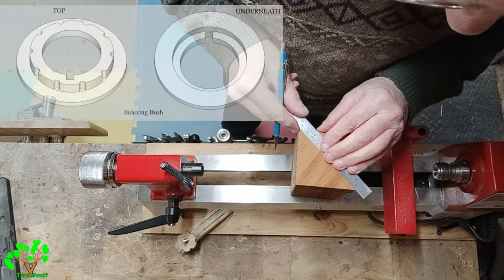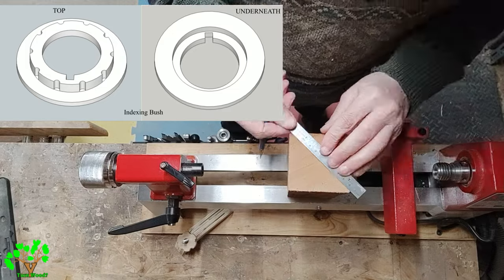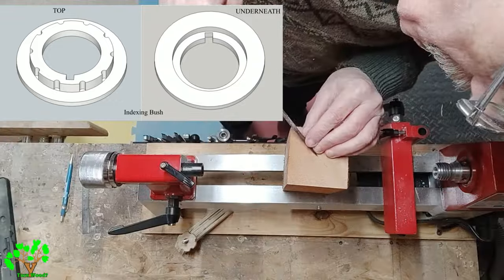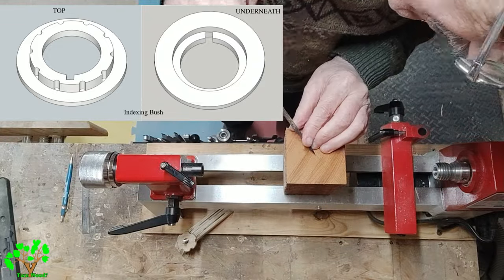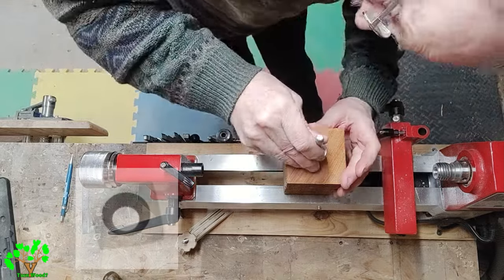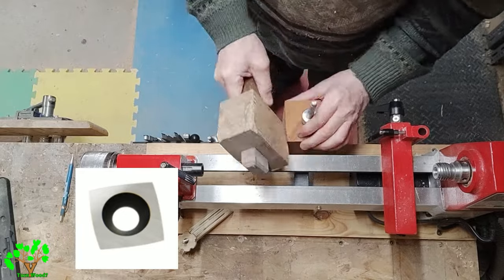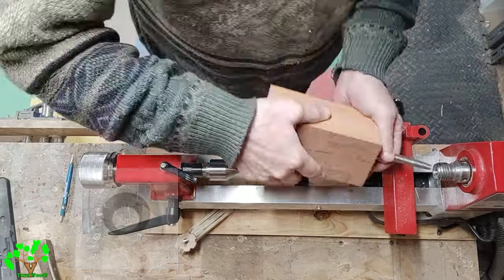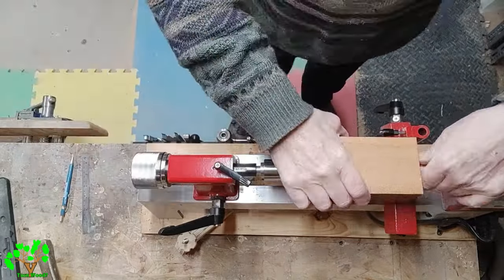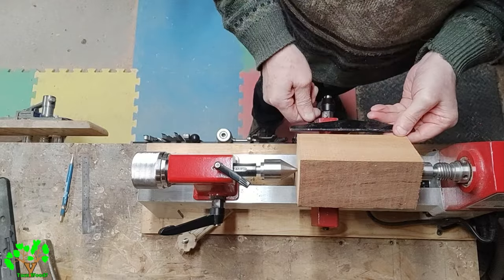Due to my essential tremors, I find it hard to use the straight tipped carbide tip tools. The one tip I haven't got is a slightly radiused tip, which is far easier to do for straight turning and facing off. It's less grabby. Well, rather than pay for the expense of another tip, I'd prefer to go back to my normal traditional tools and use the spindle roughing gouge.